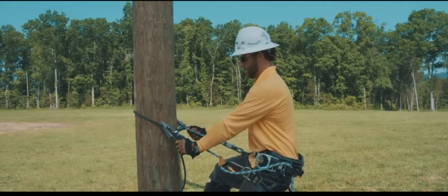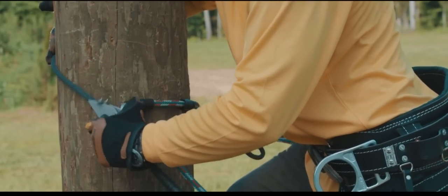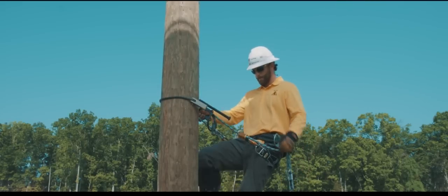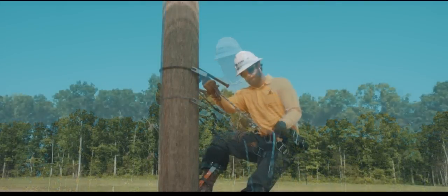When descending, the rope is lengthened by leaning in, removing the tension on the line, and sliding the adjuster back down the rope, lengthening the line. The correct distance from the pole is maintained with the rope adjuster secured to the inner red, white, and blue line.